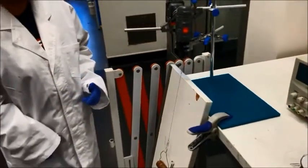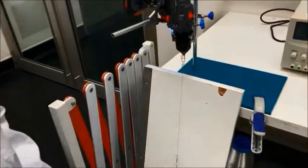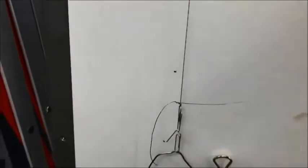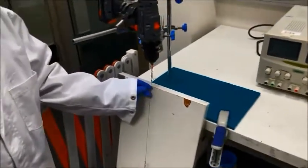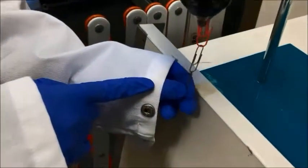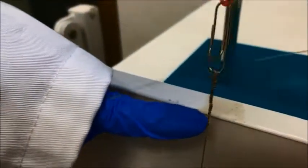Now coiling will begin randomly, but we have a little trick where we pinch the top of the fibres and lift the weight to the upper clip, and that initiates coiling at the top part. We insert some twist, then just pinch the fibre and lift it a little bit, and this will start the coiling at the top of the fibre. Once the coil is initiated, we find the coils then add to that point.